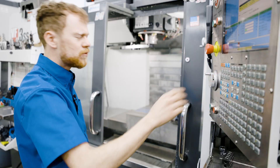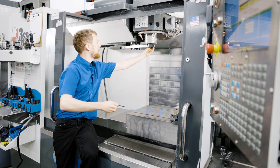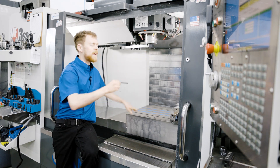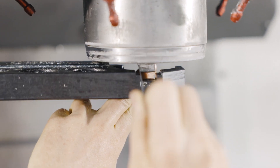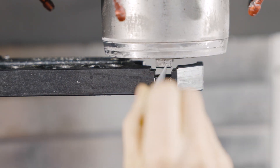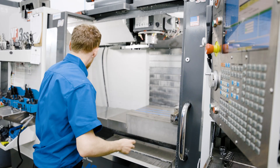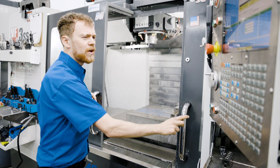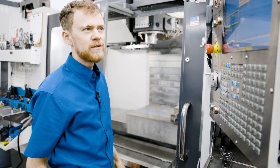You don't want to go too much further. Now you can look inside the machine and verify that there's equal space on either side of the dog and that your scale fits easily on both sides. Just a machinist scale is the right feeler gauge to check the gap on both sides. Now I'll close the door and we're going to go back to our service page in the position display where it shows the spindle position.